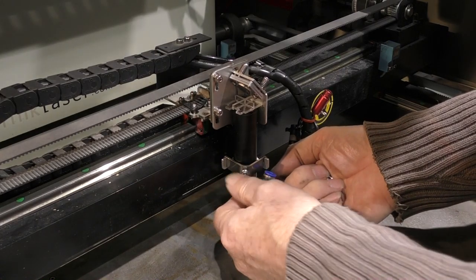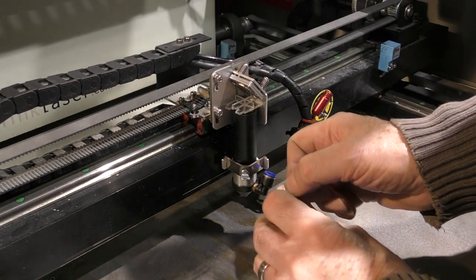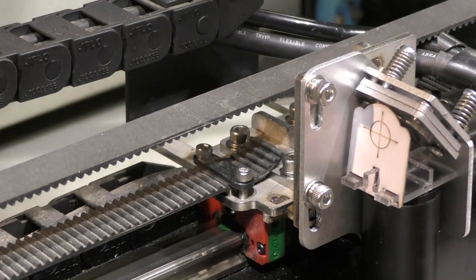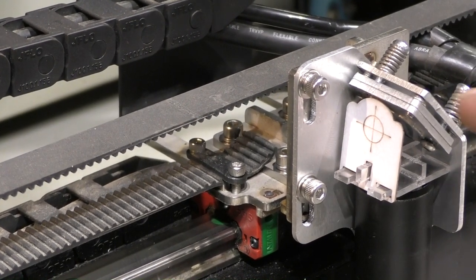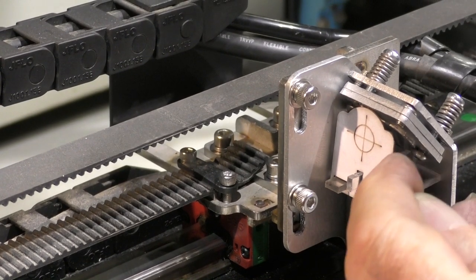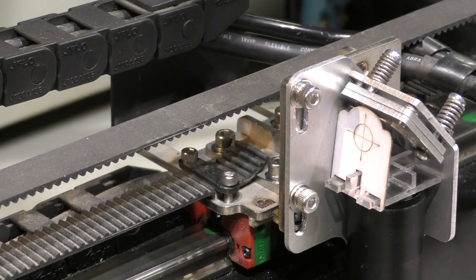as an end stop to set the height of my jig there. And then I'll put my target on these little pins. That's lined up with the centre of the mirror. That doesn't mean to say that it's going to be perfect alignment down the tube. That's just our initial rough setting, if you remember, to get it approximately in the right place on mirror 3. Now, I can be absolutely sure that the burn is probably going to be out here somewhere at the moment. So we'll just put something sacrificial on there in a moment, just to see how it goes.